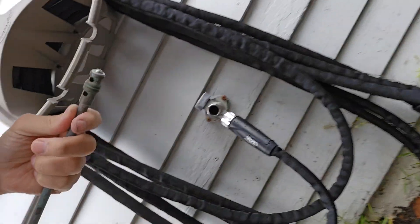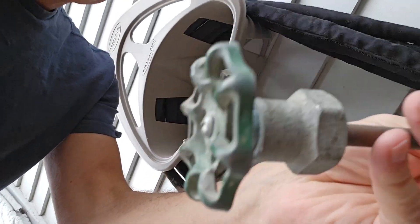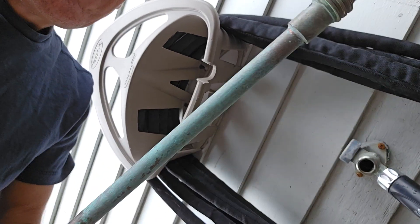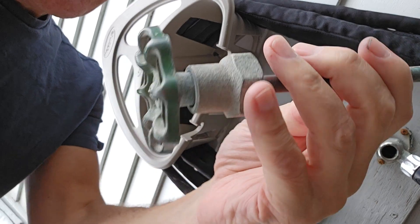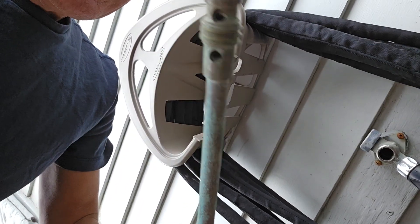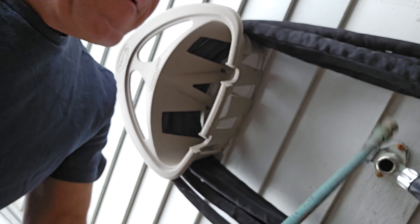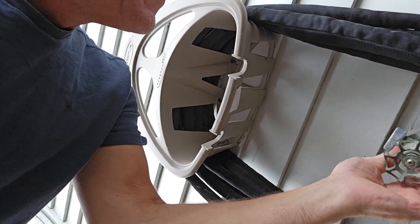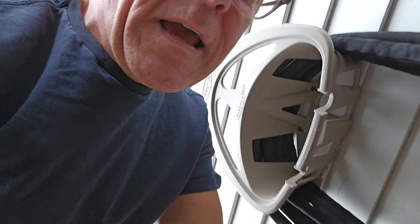All you need is a good pair of pliers to get at the neck. For this type of handle, other handles you may need two sets. But all you're really doing is unscrewing it, popping it off, replacing that washer, and then sliding it back in and tightening it back up — and your leak will be gone.